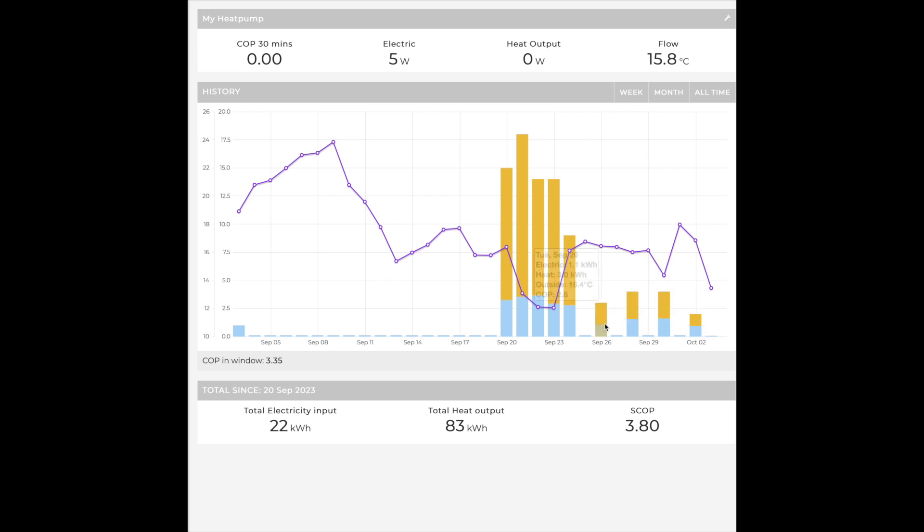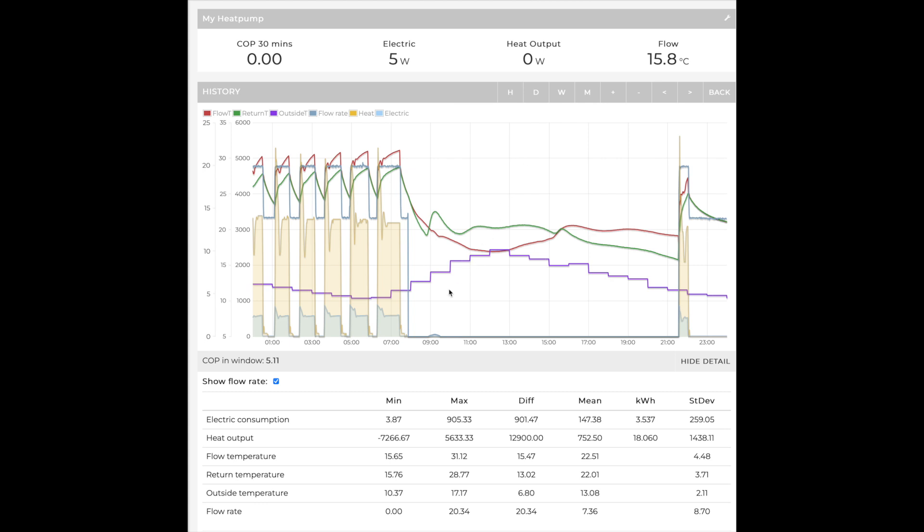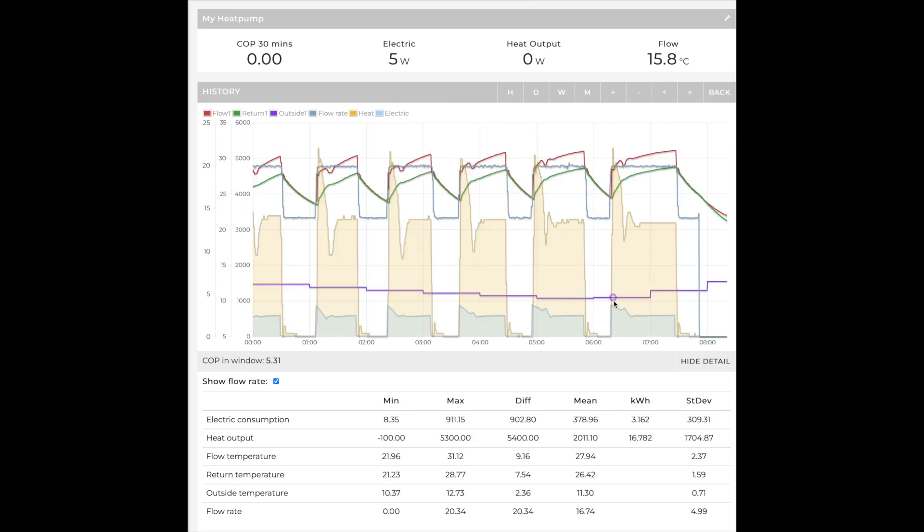So that's the update — still a work in progress. The system is working really well. The great thing is the heat meter helped us identify the issue with trapped air, which we wouldn't have known about if we'd just used the controls and mechanisms supplied with the heat pump. It does allow you to identify additional problems you would otherwise have been blind to. Any questions, give us a shout — I'll pick them up in the comments. See you on the next video. Take care, bye.